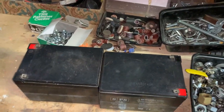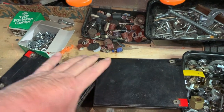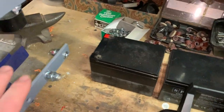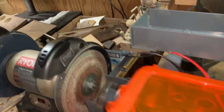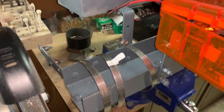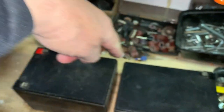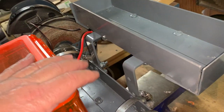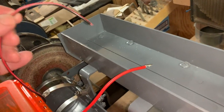You're going to get the bracket which holds the batteries — we don't give you the batteries, you'll have to buy those. Each battery is a 12-volt, 12-amp battery and they're wired together for 24 volts. I'll need to know the diameter of the back of your mower and what model mower you're getting. For 24 volts, you'll have a minus wire and a plus wire connected together, and a minus and plus coming out of the electronic housing.